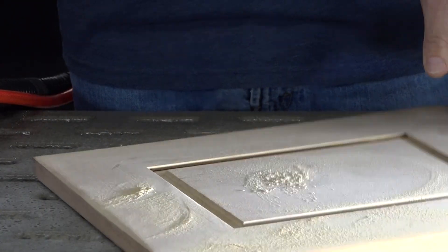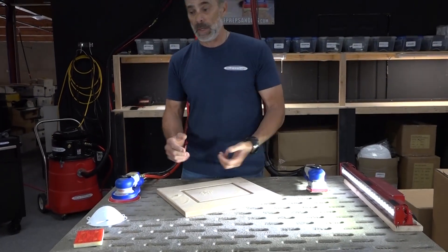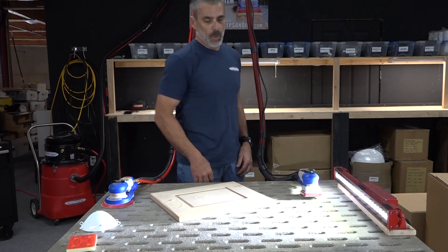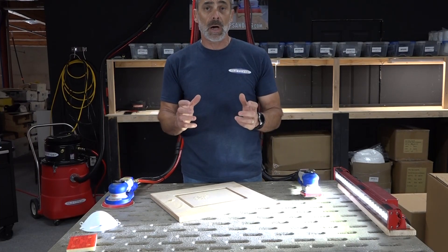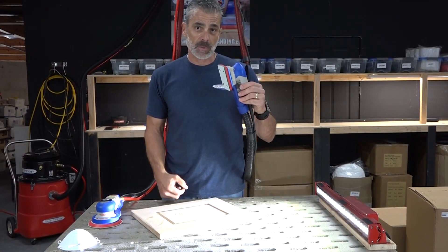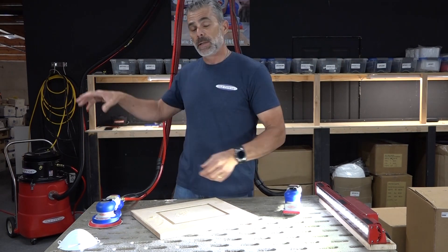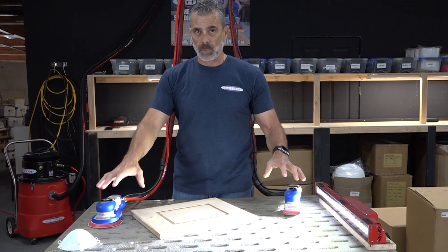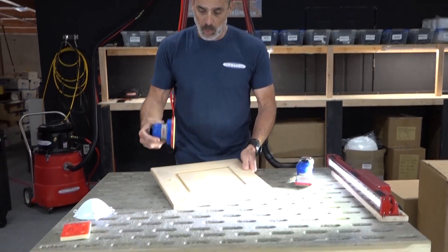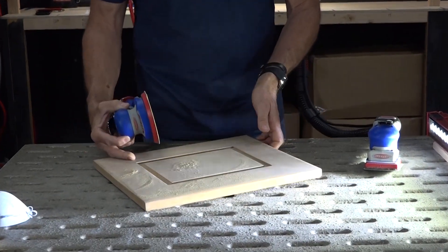I'm going to turn my two-operator vacuum back on, turn the downdraft table off, and show you how we're going to pick all that dust up now. So I'm putting this back in auto mode. The auto mode on our two-operator vacuum is great because you can run two air sanders or two electric sanders — doesn't matter five-inch or three-by-four, air or electric — and it automatically sends a signal once you depress the throttle lever to engage the head. My vacuum is back on and I'm going to show you by hitting the throttle lever the central vac feature — we're going to dust this up and then sand and pick all this dust up.